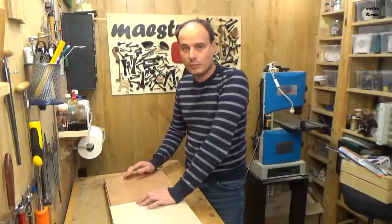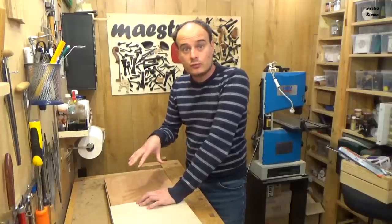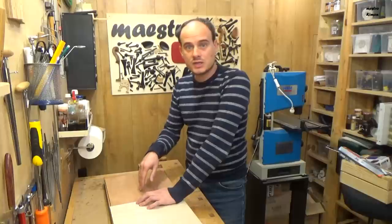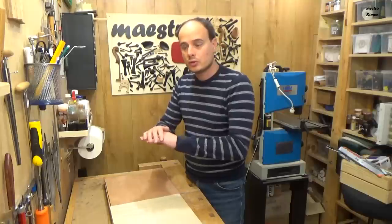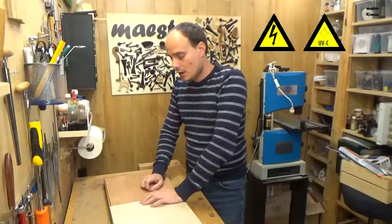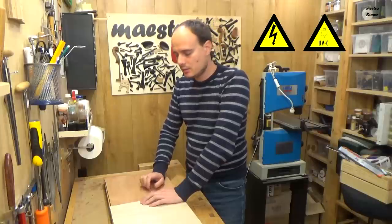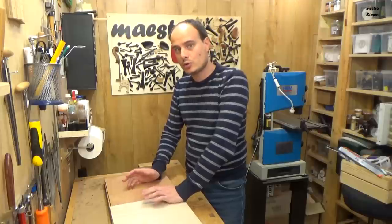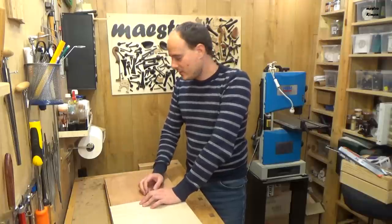The only part I'm still missing is a UV lamp — I ordered it this morning and it will arrive by the time this video is almost finished. I have to say: be very careful. The light going in the chamber is a UVC light which is very dangerous for your eyes and also a bit for your skin. Read the disclaimer in the description. Also be careful with the electrical wiring — part of the chamber will work on 220 volts in Europe or 110 in the US. Be careful not to kill yourself.